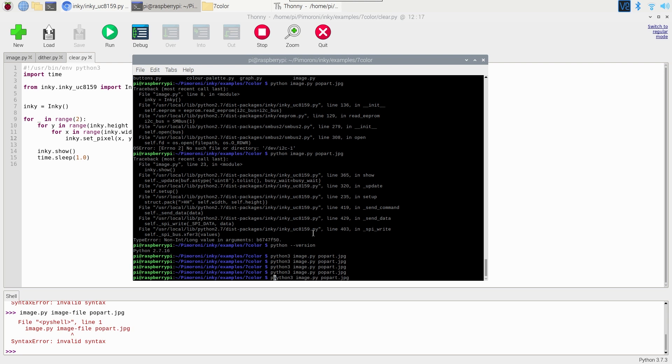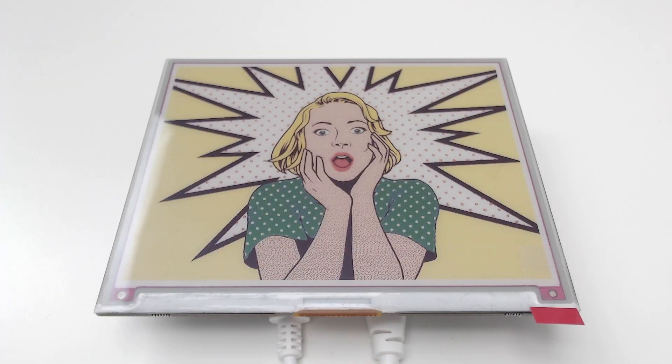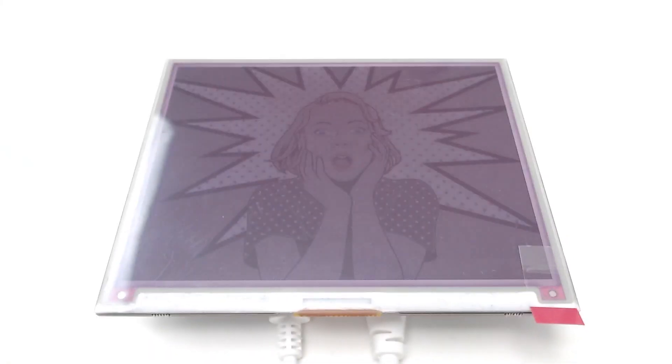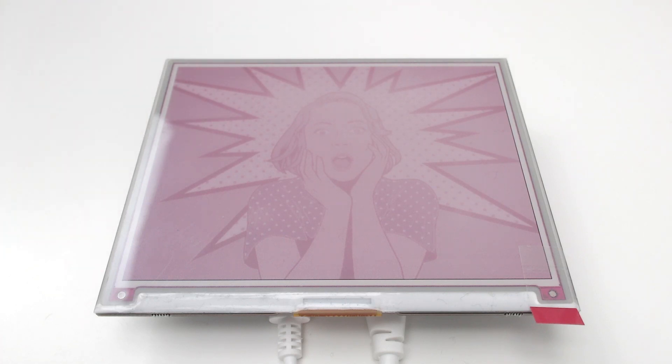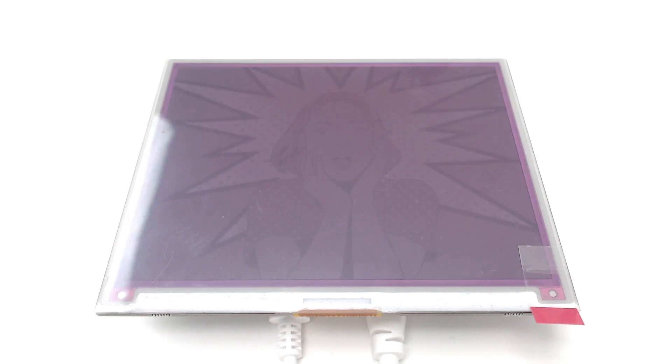Let's run a clear followed by the image again. There you go — you can see a clean cycle run. It doesn't fully blank the image visually, but it puts the particles inside the capsules in a position that shouldn't leave a ghosted image behind. If you change the image every single time without a clean in between, you'd start noticing the previous image still there, and if you do it enough times you can permanently ghost the display. I have a display with exactly that problem from repeated updates without cleaning.